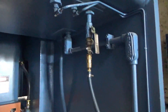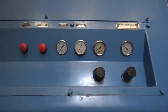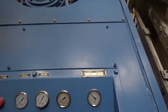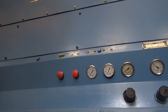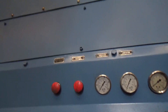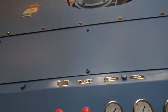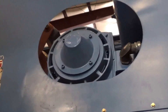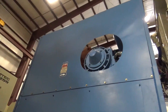Here's where the air inlet is. And here's where your air controls are: counterbalance pressure, air clutch, and lubrication. Right here are the resets for the air clutch. You can see the Eddy Current drive right there — that functions well. The air clutch is behind that cover, and we have new seals installed on that as well.